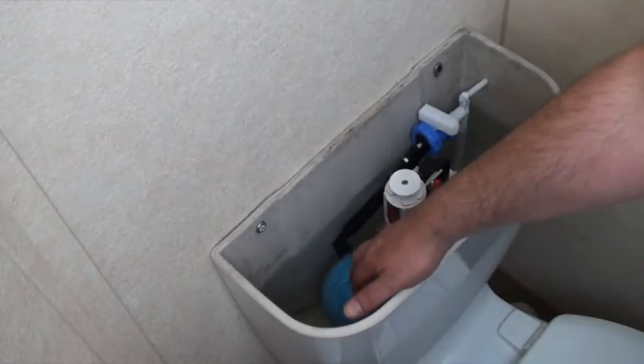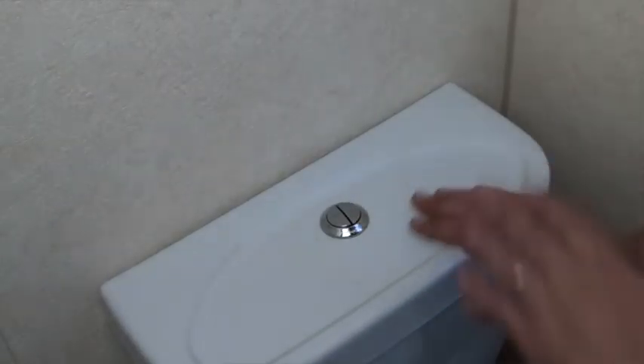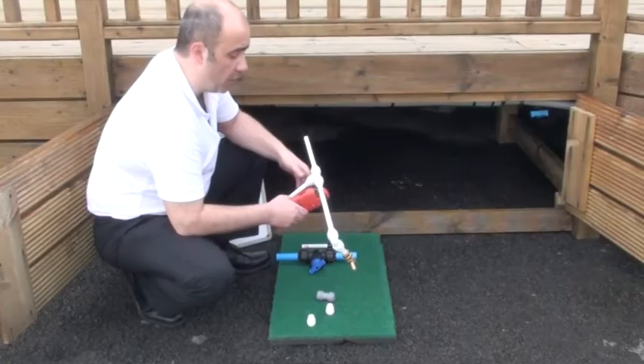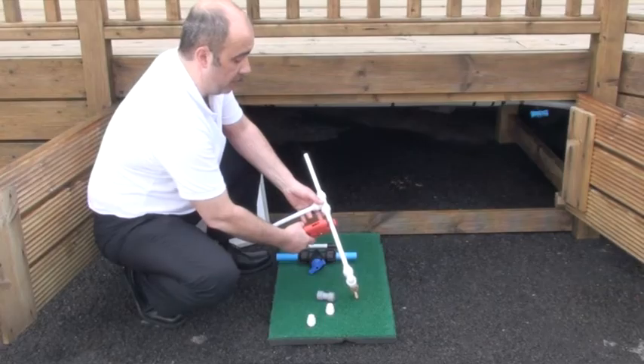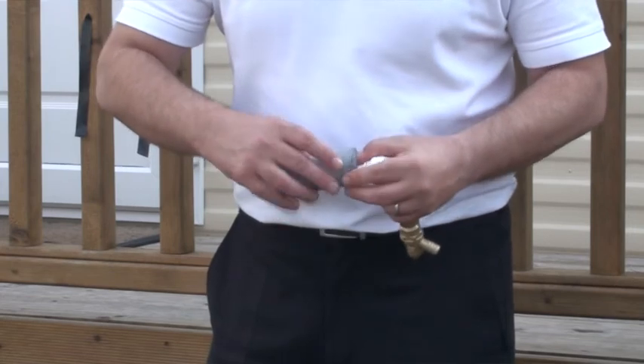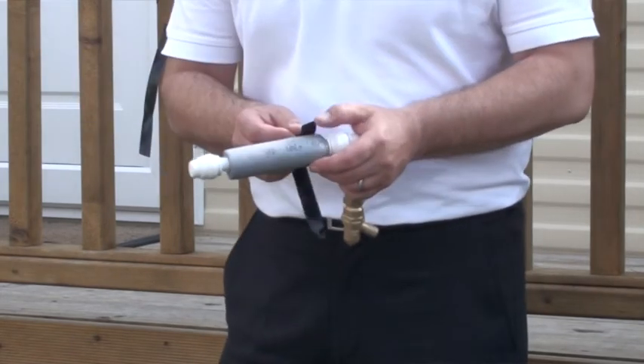Also, make sure that you drain all of the toilets by pushing the ball cocks down, but don't flush them until the very end of the drain down process. One other thing you may wish to check is the drain valves underneath the property. These are used in the old antiquated method, and we don't need them. In the chapter for fitting Flow, I'll show you how to remove them, but if they are still connected, you'll need to drain them. There really shouldn't be an awful lot of water in there, if any, but for your first time out, you might just want to drain these. For peace of mind, I would consider disconnecting them altogether, or at the very least, foam lag them. Just make sure that you drain the fresh water drain valves and not the central heating ones, as they do look the same.